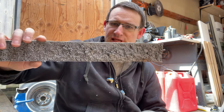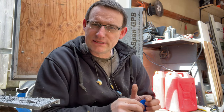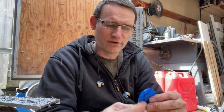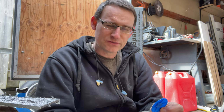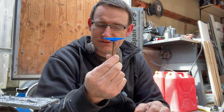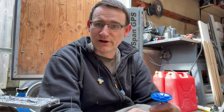I'm putting in two-inch foam — the same foam board I put in the walls — going in the bottom. To keep it in, I bought a bag of plastic washers used to hold foundation wrap on. I ended up using two-and-a-half-inch deck screws through there, and it's perfect — the two-and-a-half goes exactly into the middle of my plywood floor so I don't end up with all these screws poking through the bottom.